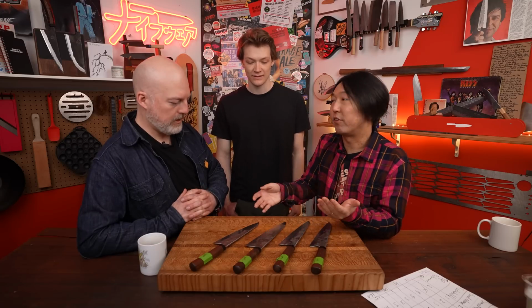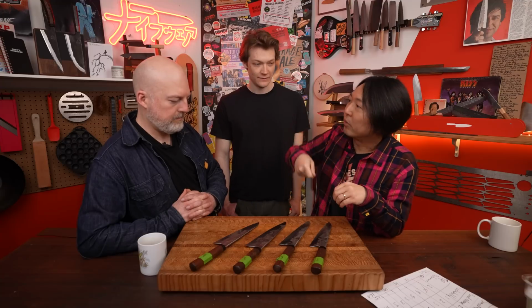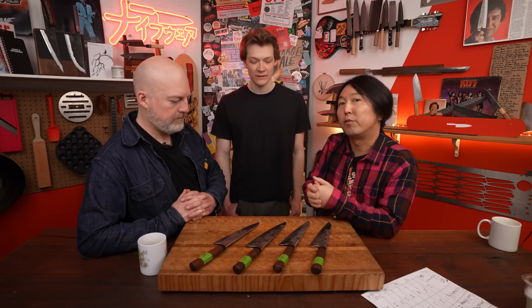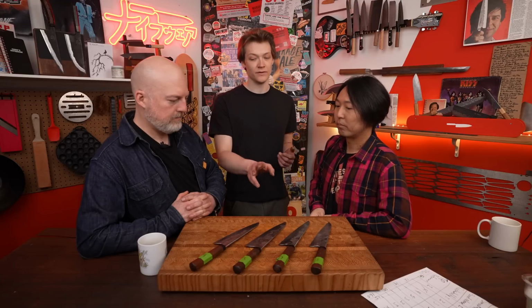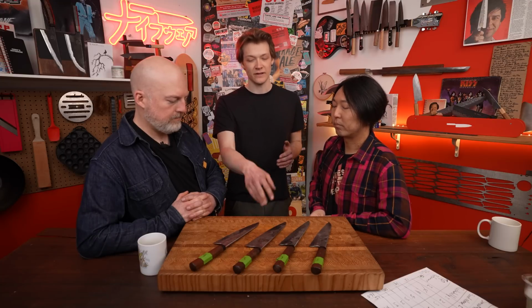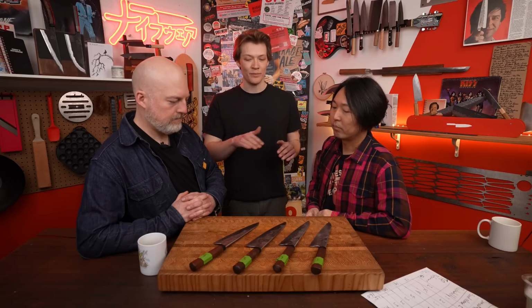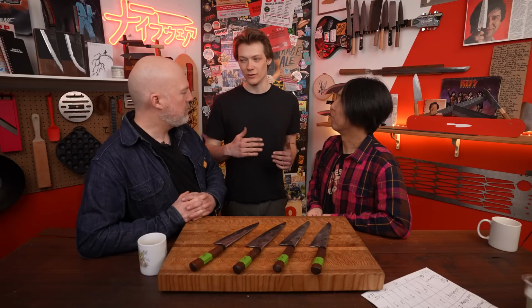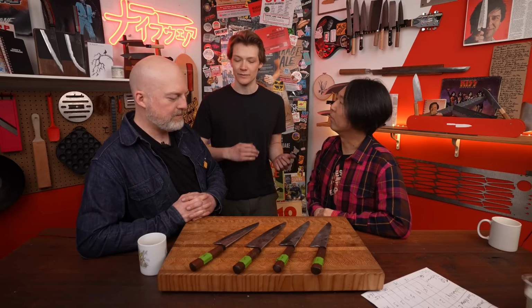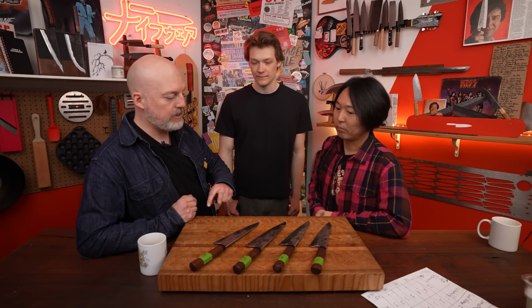3 and 4 have a very similar profile, but I think it's overall how it glides onto the food. Yeah, the main difference was I focused on 3 and 4 to have the heel, right at the back of the knife, more parallel to the cutting board. The other 2 have a little more of a triangular profile, so the handle feels really angled up a little bit. And I felt that when I alternated between the forward and the back chop.